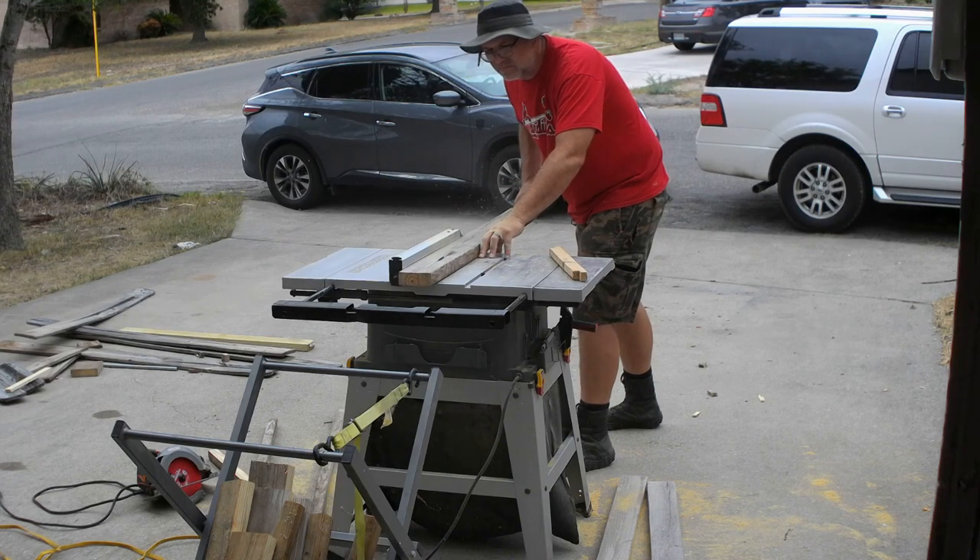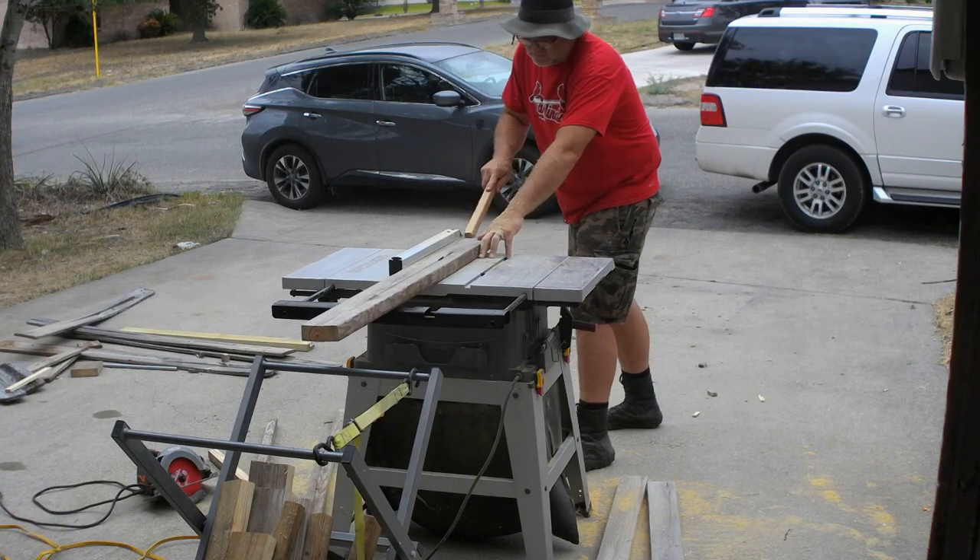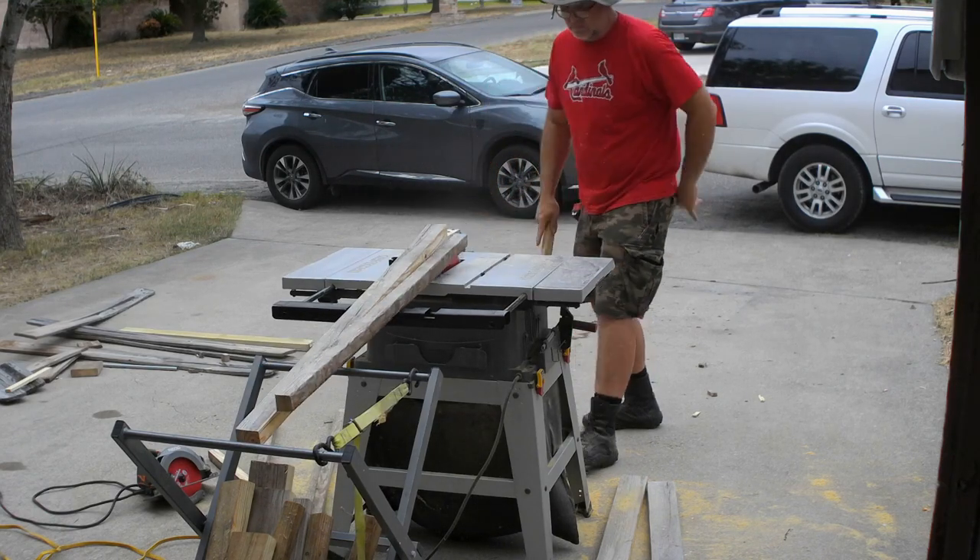On the second cut you can see the first half gets kind of difficult to feed because the tension in the wood fibers is changed by the cut in such a way that the board starts to close on the end, pinching my blade. The riving knife — that little black thing sticking up behind my blade — prevents kickback by preventing the board from pinching the blade so hard that it grabs and throws the board back at you.